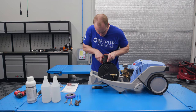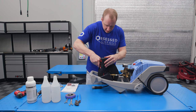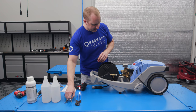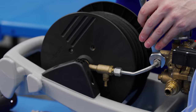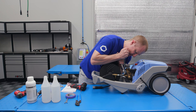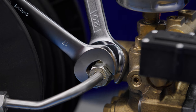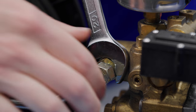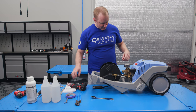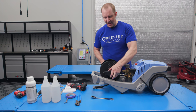Let's remove the hose reel just to give us better access. There are four Phillips screws, and then there's a single 17 millimeter that we need to remove here. The recommendation of doing this stuff is at around a thousand hours, which I'm not even close to.